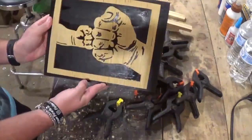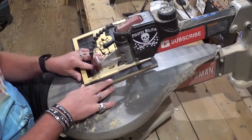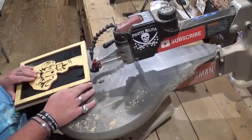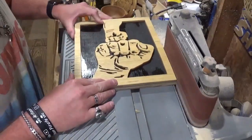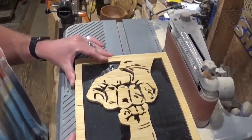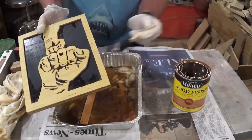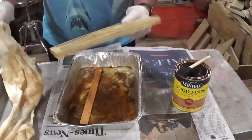I let that dry around five minutes before removing the clamps. Then it was back to the scroll saw one last time using the straight blades to trim along the perimeter and get the final size of the piece. After that it's a quick stop at the belt sander to smooth everything out, then staining the edges and the back — this is how I do all my portraits to make sure the scroll work and the backer board blend together to look like one solid piece.